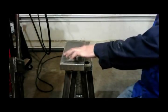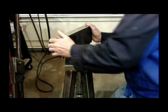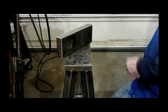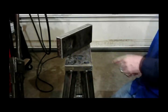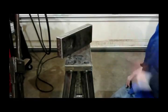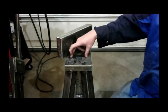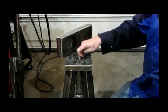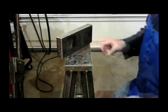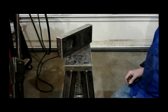You will have to true it up to get it to fit perfect — it is as-cut, basically. This lower hole is an inch and a quarter square, and that gives just clearance for anything you put down through this one. The original ones I made had a great big square hole in it, and I thought you might want to drive something down through here and then drive a wedge through it to hold it in place and make it more solid — for some things that you're striking.